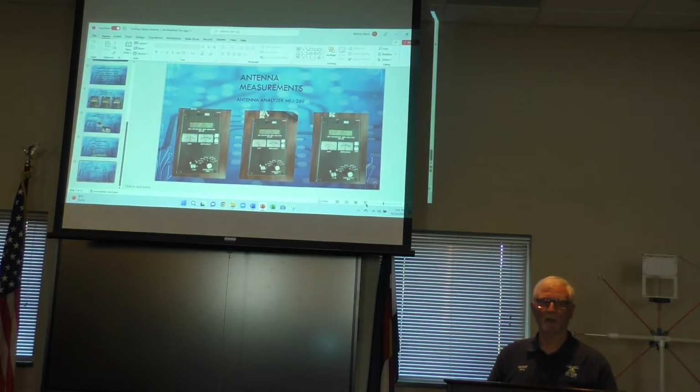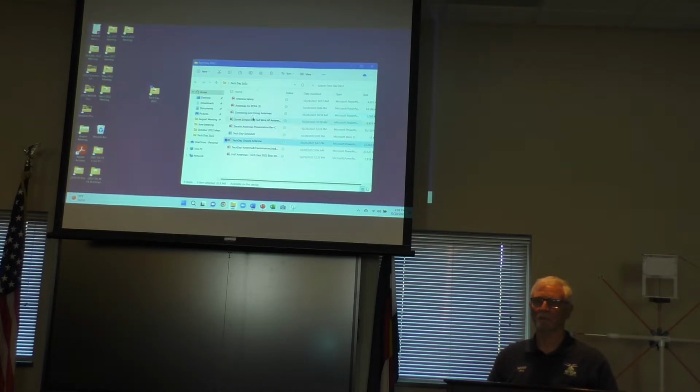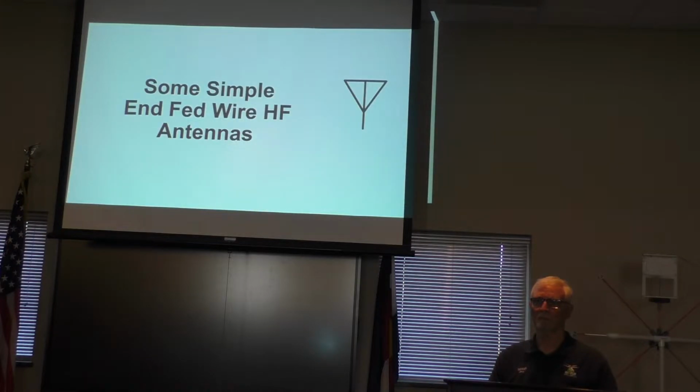So I saw one here. Yes. Just to add to what you're saying on the dipole, back in the day in the 70s when I was at my first antenna, I was introduced to this piece of equipment. Instead of cutting the coax and separating the wires, because we all know that water contamination is a no-no. I just remembered what that piece was called. It's an HQ-1. It's a female connection that's encased in really hard plastic, and these people are still manufacturing this. And basically, you take your RG58, your male connector, stick that in there, twist it down, and then just solder your two dipole ends.